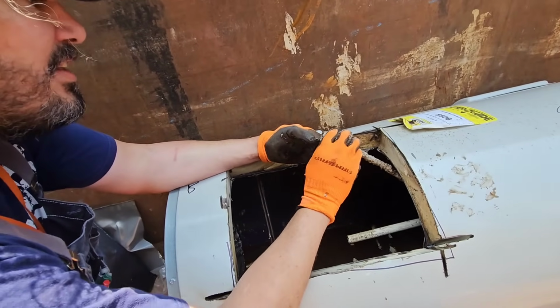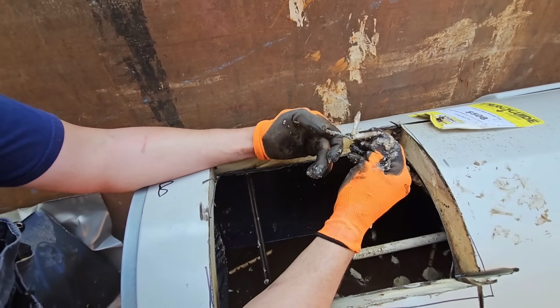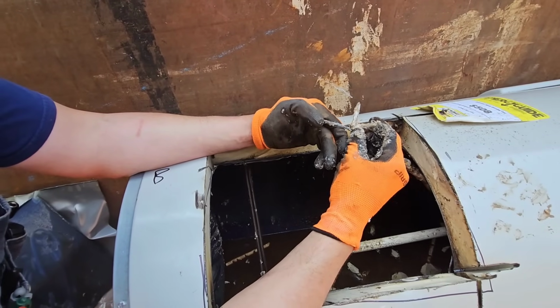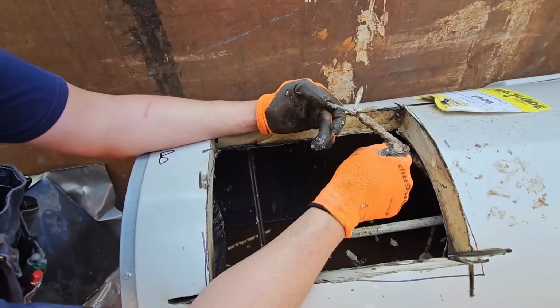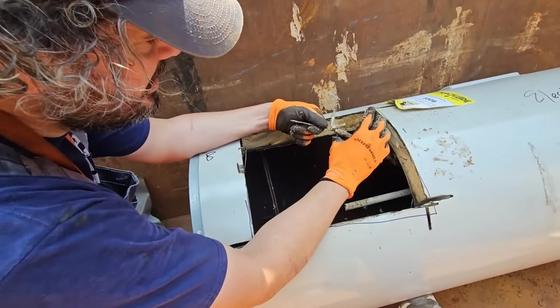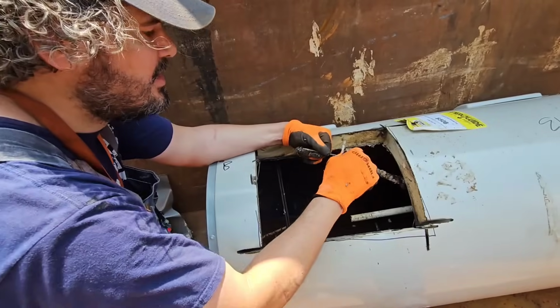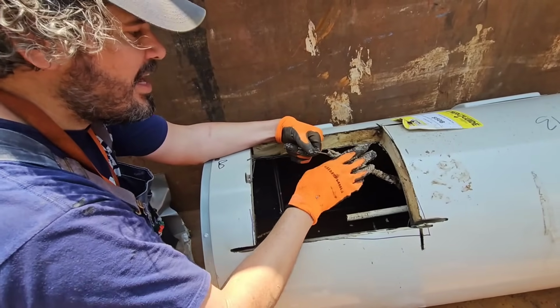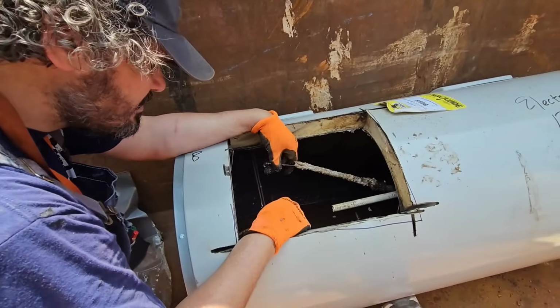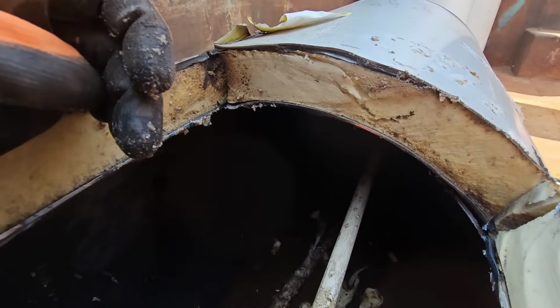Okay, so now this rod gives it something to do. And this deteriorates really small. It's magnesium. You have magnesium in your body, so there's no harm of drinking magnesium. But the way they do it is they put a steel rod, wrap it with magnesium. That dissimilar metal creates electrolysis. And then the ions in the water are now attracted to the anode rod. And that runs the whole way up the tank.